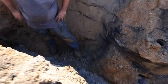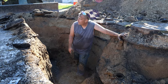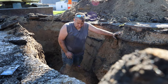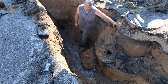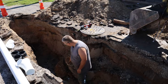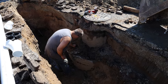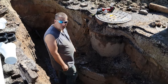Here we opened up a lazy river in our laundromat. Now that we've exposed how bad it was — it was junk cast iron — we're going to put new PVC in. We're going to tie it in there, put a good clean-out right here in line with this one, and that should fix a lot of the problems. We're also going to try to make this curve a little better so it's not such a sharp angle. We've got all our parts and pieces: Ferncos at both ends, new PVC pipe, a T, an elbow. Then we've got to redo this clean-out — replace that Fernco junk, put a new stack on, then backfill it. Let's get started.